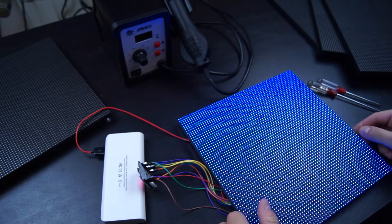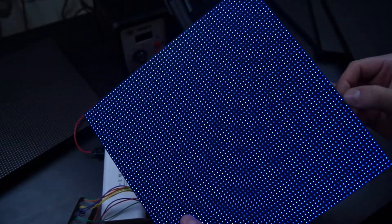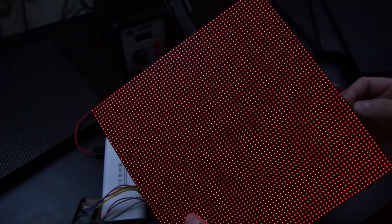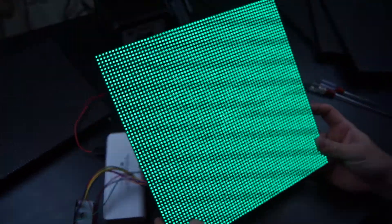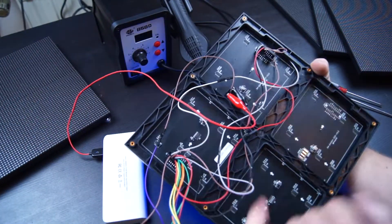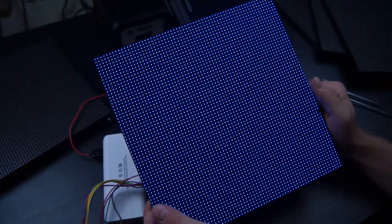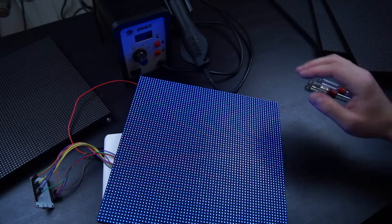In this example we have one LED that is not showing blue — every other color is fine, so red and green are showing correctly. It's just one channel of the LED that is broken. It could also be a problem with the driver IC on other boards, but in most cases it's just the LED.